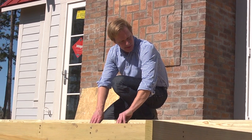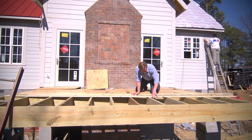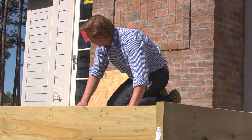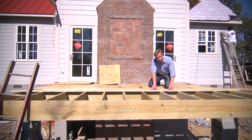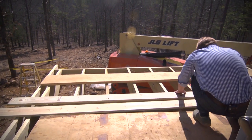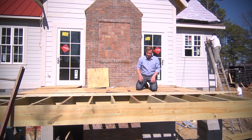The finished floor material is a one-inch thick board with a rounded edge on either side. It's six inches wide and these boards are 16 feet long, so you can buy them at that length. These will be placed side by side. There's still quite a bit of moisture in these, so he's going to pack them in really close together, one against the other. As they dry, you'll get about a quarter-inch gap. If you put a gap between them starting out and then they shrunk, you'd end up with a much wider gap.